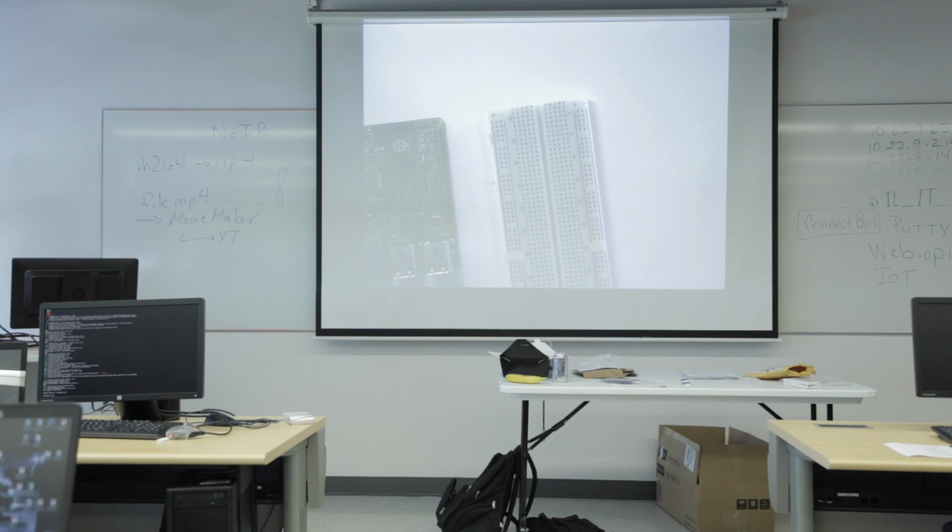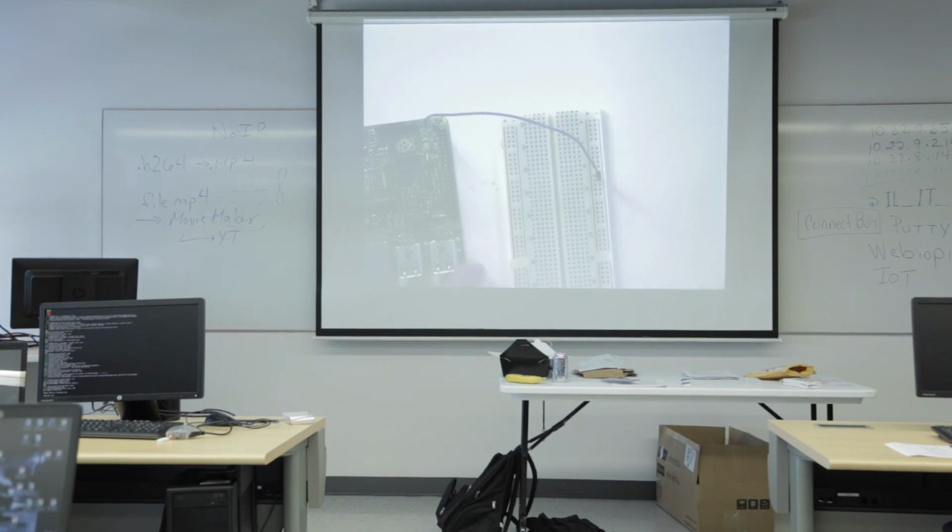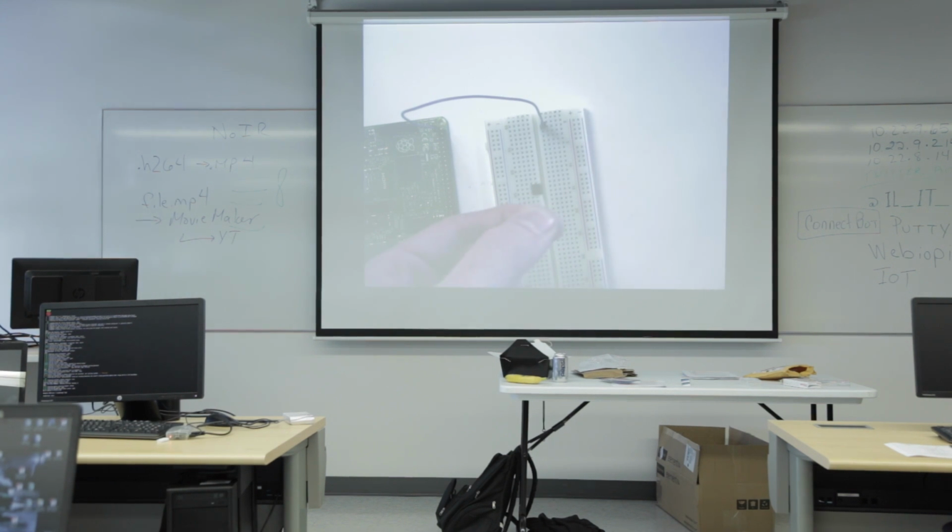The pins that we're going to use, the top left one right here, this pin, you want to plug something into that. The female end gets plugged in there. The next thing I'm going to have you do is hold on to your temperature sensor such that you can see the writing on there. It says Dallas. You hold it so that the curved edge is away from you. Then you flip it around so that the curved edge is facing in. One of those prongs goes into each one of these, like so.